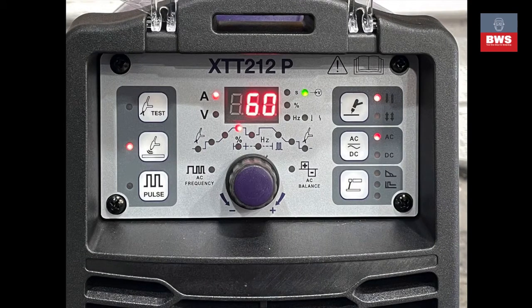The top setting is the welding current setting — here you adjust to the desired welding current. The LED will always return here even when adjusting other settings, so always remember to check which LED is lit. Press the button until the top LED flashes, then adjust. One thing I did find frustrating is that if you're not watching, you may think you're adjusting the welding current but you're actually adjusting another setting — it's very easy to move off it. If you use a foot pedal, this current setting will give you the maximum current you will achieve with the foot pedal fully depressed.